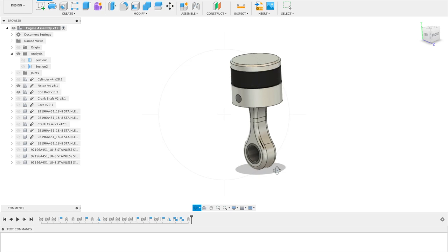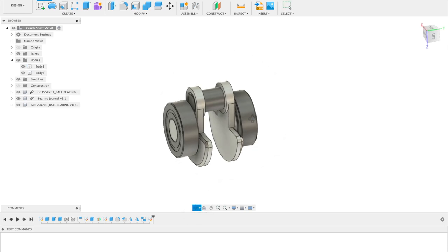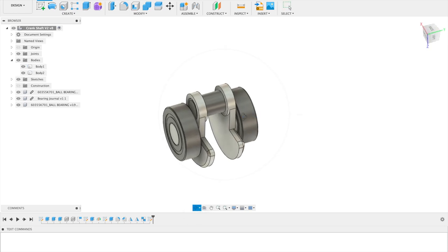There is very little contacting surface between the aluminum of the connecting rod and the aluminum of the piston. About 90% of the contacting surface is between the stainless steel wrist pin and the bearing, which will greatly reduce friction due to aluminum-on-aluminum contact. I know this will cast well because I've casted it, and the connecting rod is a very simple geometry so I think it will also cast quite well. The next part is the crankshaft. It's made up of a few parts: two bearings, a stainless steel journal bearing, and two casted halves that act as counterweights and hold the whole thing together.